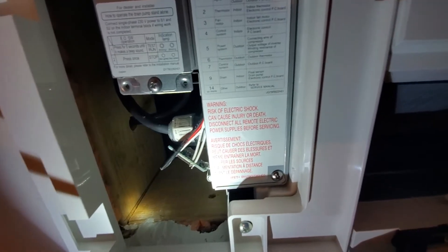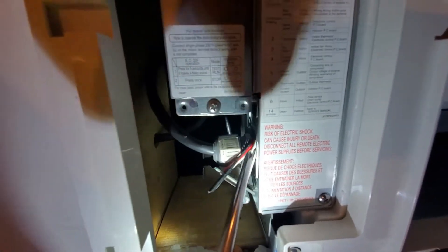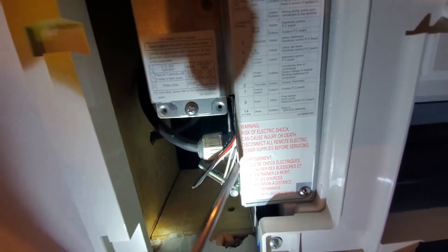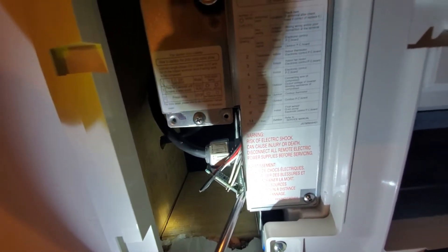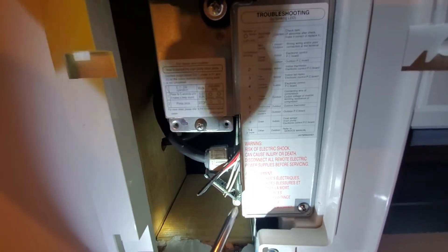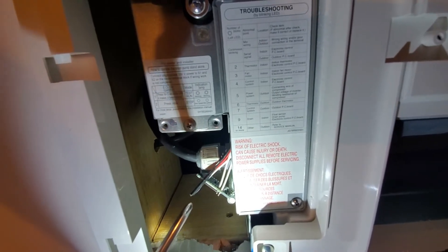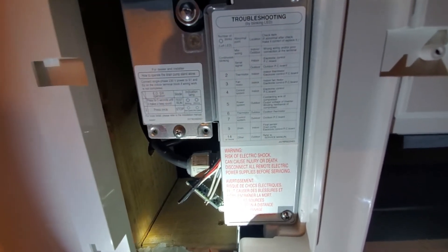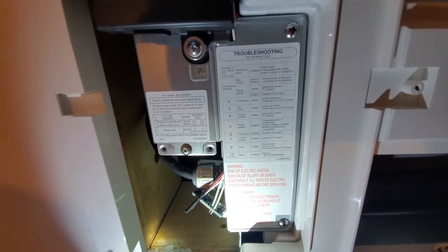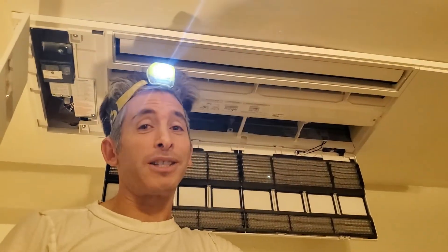There it is mounted in — there's no friction here, it's just floating. None of these wires are compressed. I'm going to put a piece of electrical tape to stop the USB from touching this electrical cover plate. I've got the Wemos set to do over-the-air updates so I never have to go back in here again. And that's it — we can go and control that from our home automation system, which is Home Assistant in my case. Thanks for watching, remember to like and subscribe.